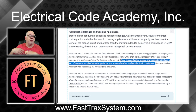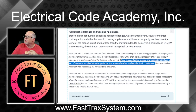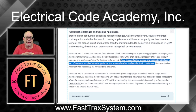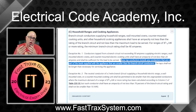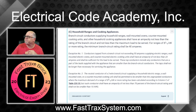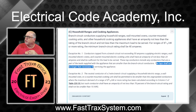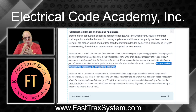It also goes on to say these tap conductors include any conductors that are part of the lead supplied with the appliance — that's the whip — that are smaller than the branch circuit conductors. The branch circuit is what's coming to the junction box, so obviously these taps will be smaller. The manufacturer will often handle those if they're included, but many manufacturers are now not including any whips at all, so you have to figure that out. And these taps shall not be longer than necessary to service the appliance.